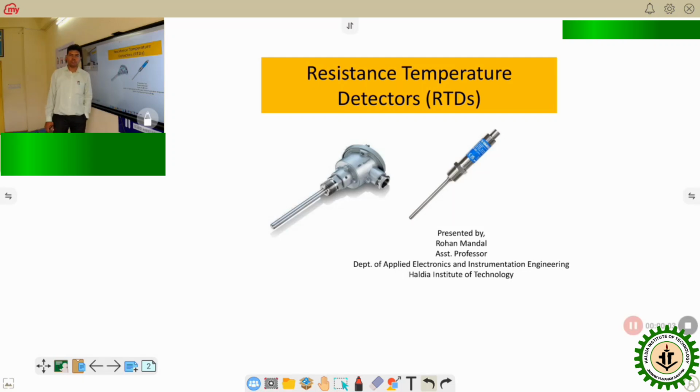Hello viewers, this is my second lecture on the topic of sensor transducer, where today I will discuss the resistance temperature detector, which is one of the mostly used temperature sensors in the industries. The resistance temperature detector is a resistive temperature transducer, where the temperature is measured in terms of change of resistance of the conductor. So how it works, let us see.